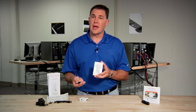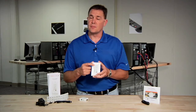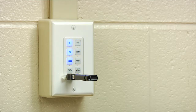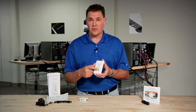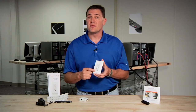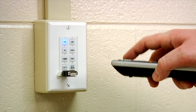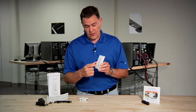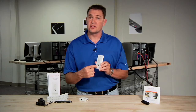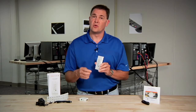A perfect example of downloading would be installing a new controller in a classroom next door — you can take the known good script from another controller, download it to a memory stick, take that stick to the controller next door, upload it, and repeat this for every classroom you need. Another programming option is through IR: you can learn IR programming through the front of the remote control panel without removing it from the wall. Just take the remote control, learn all the commands, and — just like with RS-232 or PC programming — you can learn four commands per stack and choose between repeat, sequential, and fire all. This allows you to program an entire classroom in less than five minutes using all IR, then download it to a memory stick and go from room to room — it's that simple.